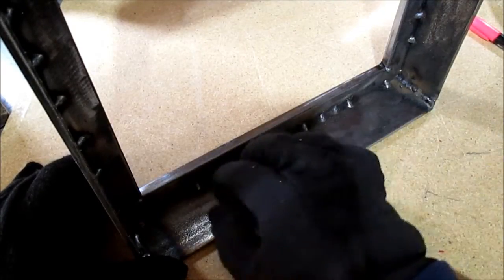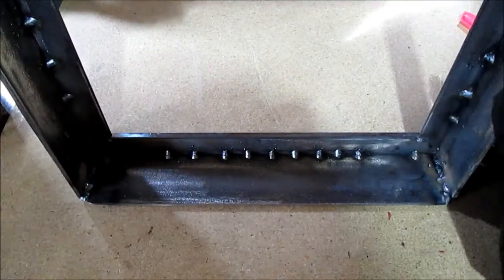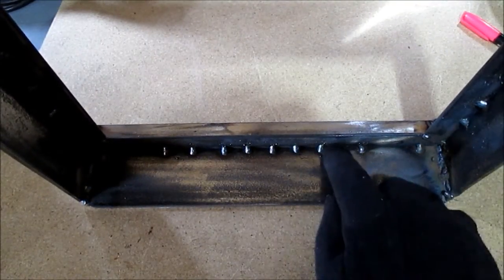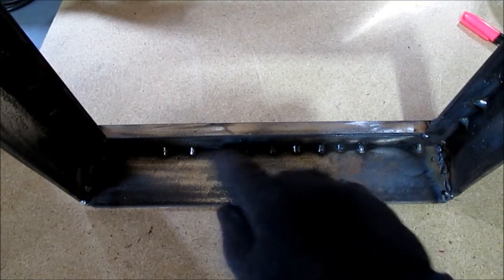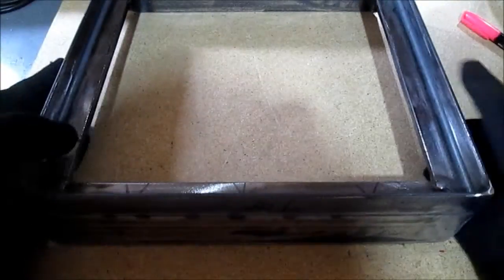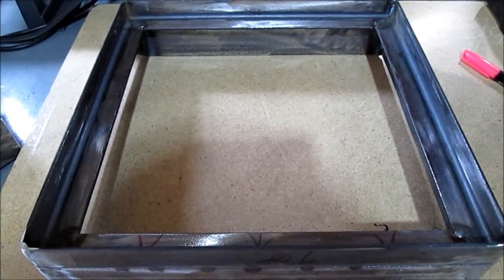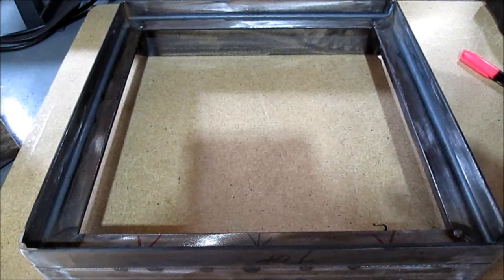We're not gonna weld this completely. We may just go back and make more spot welds. This is not structural. It is not going anywhere when the stove gets hot. We may run like a bead. Skip 1 inch, run a bead between these, make sure the corners are welded good, but it's not going to have to be welded solid. There you go. Off to doing whatever we do next. I'm looking at the timer. We talked too much about this part.